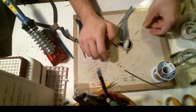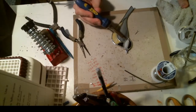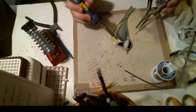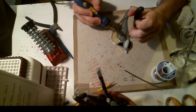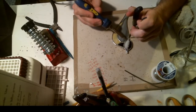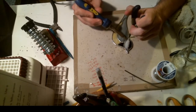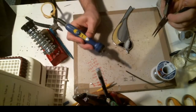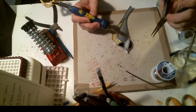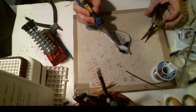Okay, it doesn't look like I'll need to bend the legs of the hook. It's gonna melt where I want the hook to go, aligned with the solder line. I'm just gonna press on the legs to transfer the heat through them into the solder below. Ta-da! I'm gonna need to bury it a little bit more. Voila! Make sure that it didn't melt through the other side.